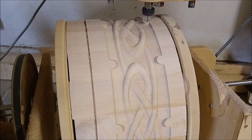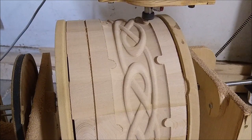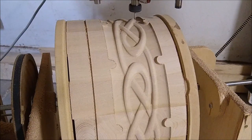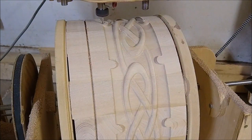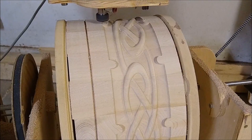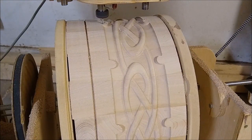Fast-forwarding past all the 3D cutting — now it's time to drill the holes for the lugs. You'll notice it goes down, drills a little bit, tracks back up to let the sawdust out, then does it again and again. It's called pecking. It removes all the sawdust from the hole as you're drilling. If you have too much sawdust in the hole, it causes heat and friction, which can ruin a drill bit, or in a worst case scenario, you can actually start a fire if you're not careful.